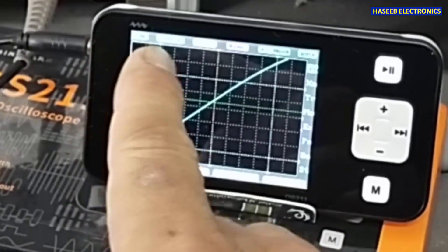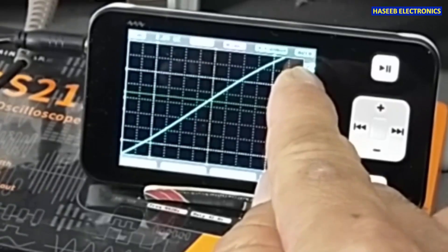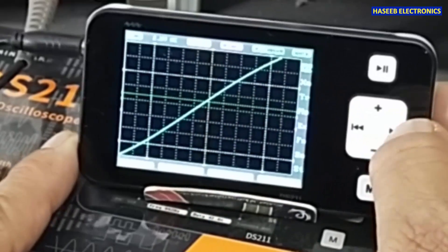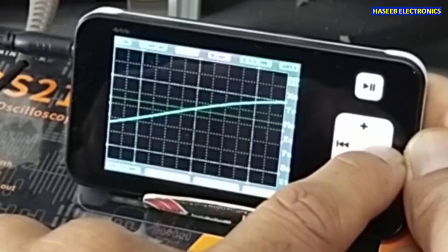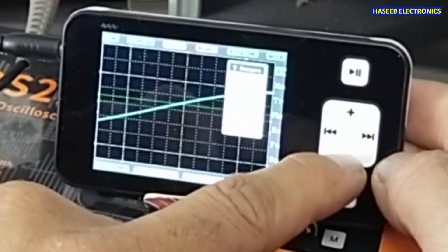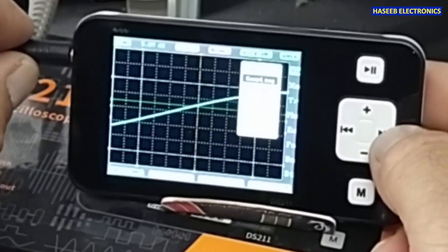Here is the battery voltage. The volts-per-division indicator is blinking, meaning we are in volt-per-division setting. The selected menu is YN, meaning if we set this button we will change this setting. Y means vertical setting. At 5 volts per division we can see the signal amplitude decreasing. To enter the Y-axis submenu, press M then scroll down to coupling. Here is AC coupling; selecting right side gives DC coupling — we can toggle between AC and DC.